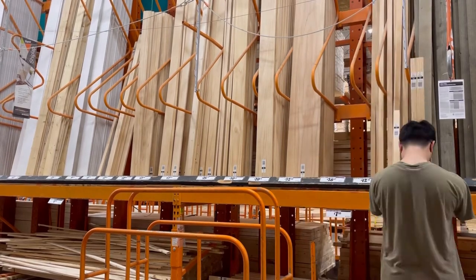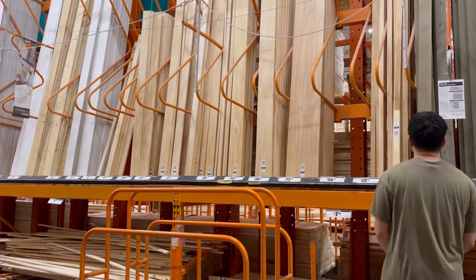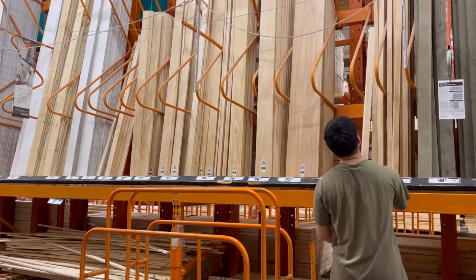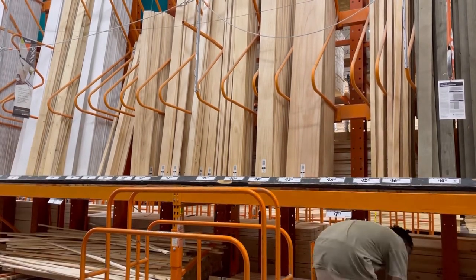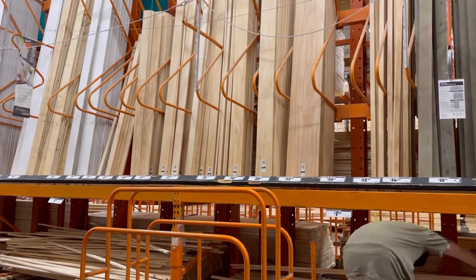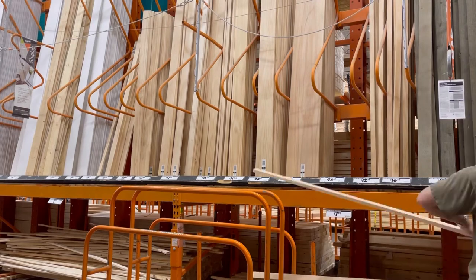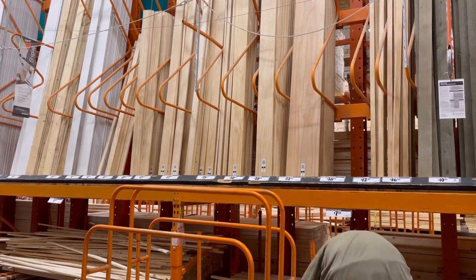These types of lumber that I'm buying are called dimensional lumber because they have been milled on all 4 sides. In theory, they should be square and I won't need to use a jointer or planer to get 90 degree angle faces. However, that isn't always the case. So I select the wood that I want to buy carefully. The trade-off for dimensional lumber is that they're more expensive.